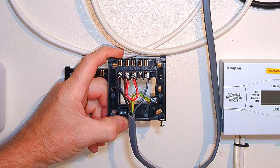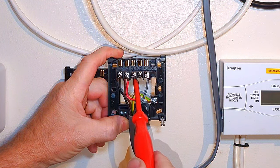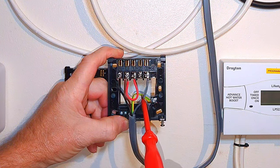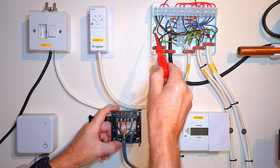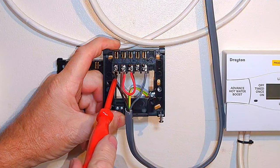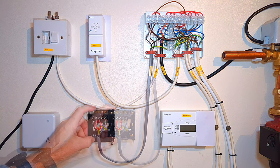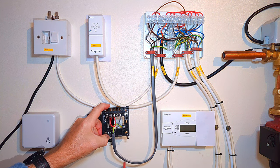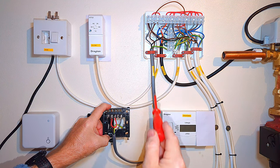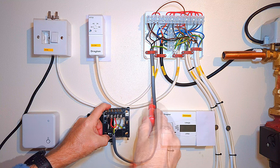Here's how that wiring would look: a live comes in with a link wire to terminal one giving power to the switch wire, then through the thermostat switch, out on the gray wire to the zone valve or mid-position valve. I've connected up the additional third wire as a neutral to complete the circuit and run the receiver unit, with the neutral also connected in the wiring center. However, I would not recommend this method because you can't tell whether that wire running back to the wiring center has been cut or modified over the years. Since I'd be checking the wiring inside the wiring center anyway, I might as well wire the receiver unit in there from the start, which also removes that old wiring going down to the old room thermostat.